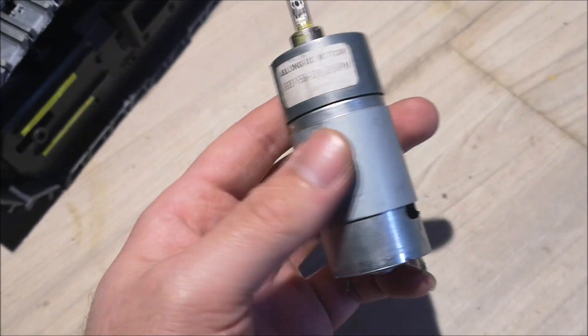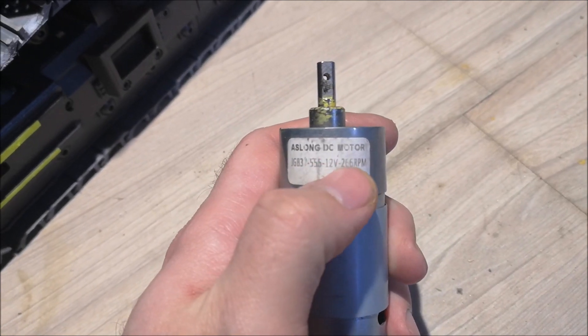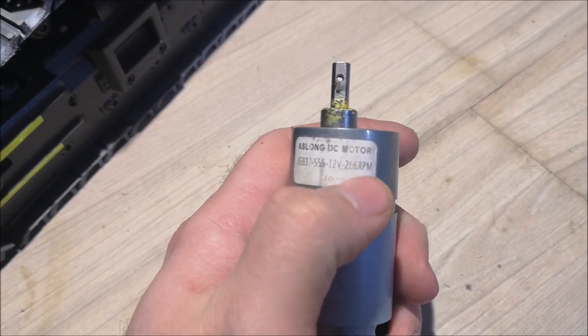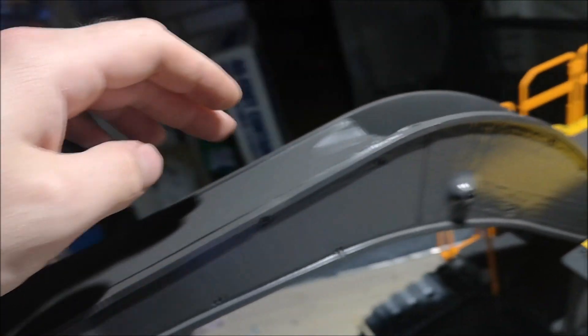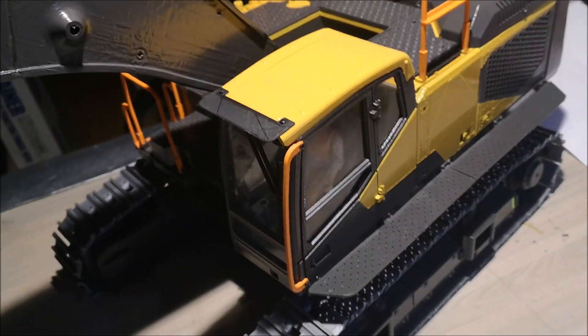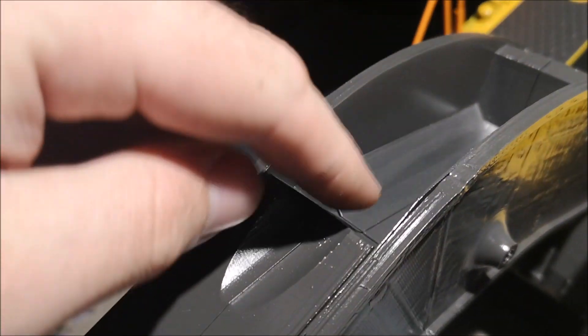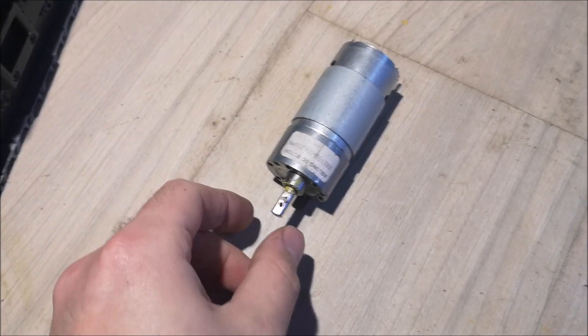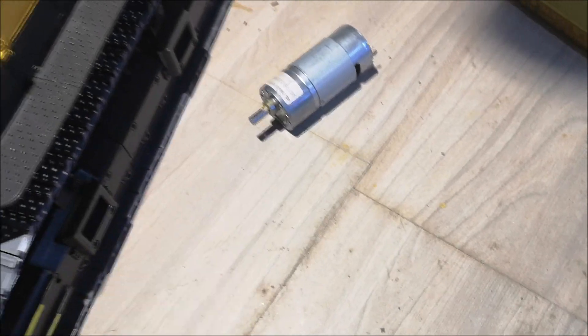So let me get around to that and I'll see you soon. This is the motor that I used to move the arms and the bucket. This one in particular has 266 RPM at 12 volts. The plan was to use this motor to move the stick, but first I have to create a motor mount to sit inside here. I want to make the motor mount out of steel so I'm sure it will handle all the stress. Let's get to it.